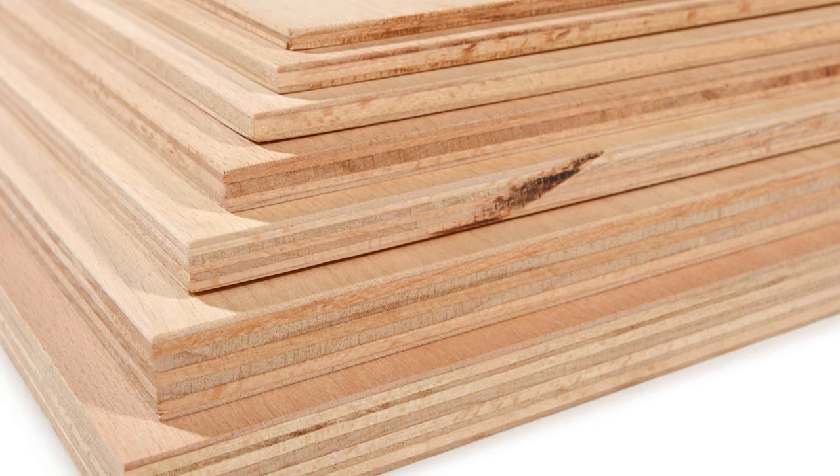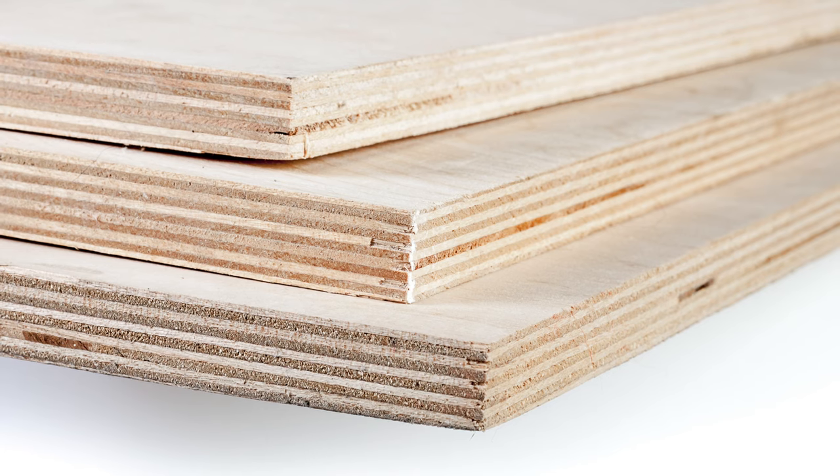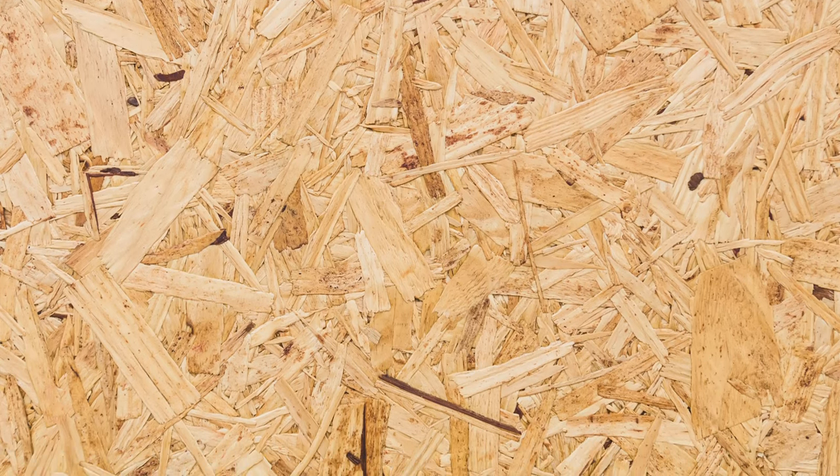The main difference is basically how they're made. Plywood comes in various different sizes and it has plies — thin sheets of wood that are glued together. For half-inch plywood you could have anywhere from three to five plies; five-eighths plywood, four to seven plies. OSB, or oriented strand board, is wood chips that are glued and hot-pressed together into a solid board. Half-inch OSB starts off as six inches of chips and glue and then they press it with heat to make oriented strand board.